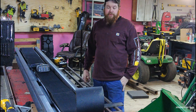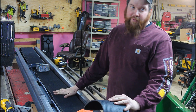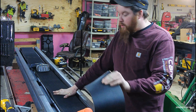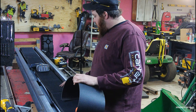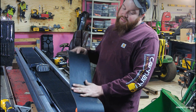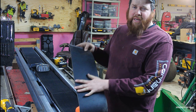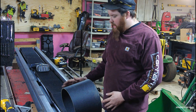On this episode of Dirt, Grain and Steel, I'm going to show you how to splice a hay baler belt — which I'm actually using as a conveyor belt to make this 12-foot long conveyor to get pea gravel out from underneath my trommel. I made this conveyor out of C-channel and used poly plastic cutting boards for the belt to slide on, so I didn't have to make rollers. This conveyor is not going to handle a lot of material all at once — it basically just dribbles on — so this will be plenty to handle what comes out of the trommel.